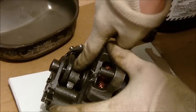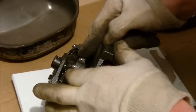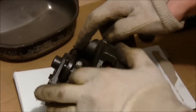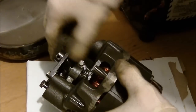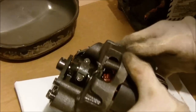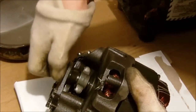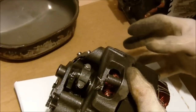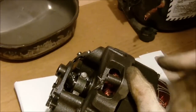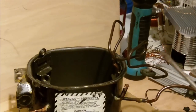So it has its own oil pump. To convert this to a steam generator, this engine would be open — there'd be no lubrication on the actual crankshaft. The connecting rod bearings and the wrist pin bearing would be dry, so it's not going to work very well unless it's in its enclosure. This thing would have to be put back into its enclosure, because it wouldn't have a way of lubrication unless you designed an oil link system running off the crankshaft or drive shaft. If you have no use for it, you could always turn it into an instrument.